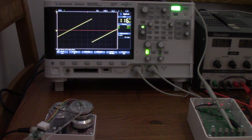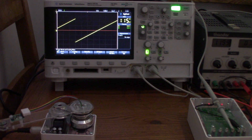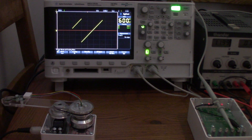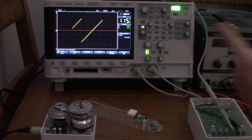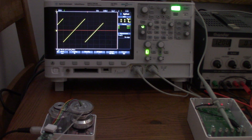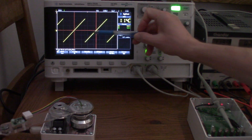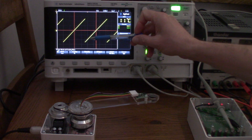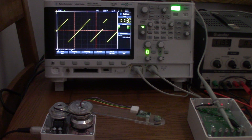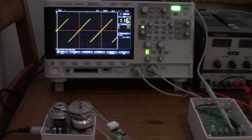We've now got the two-to-one ratio table set up with offset 30. The frequency is going to be really hard to catch because it's half of what it was before, so the scope will struggle. I'm slowing the scope down to a two-second time base. The signal goes from north to south — we're getting 137 millihertz, confirmed again at 137 millihertz.